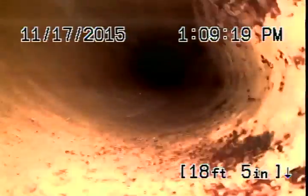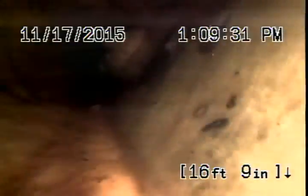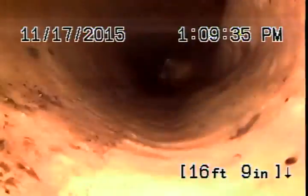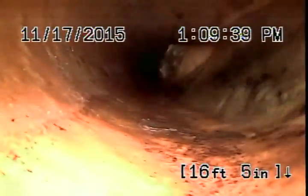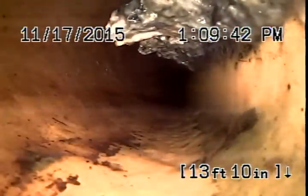Possibly the roots have broken the outside of that pipe and are now pushing on the liner. Some of the spots might be broken — you can't really tell since it goes under sewage water right here. But you can see a bump there creating negative flow, and in the future that's going to create stoppages like this one right here.